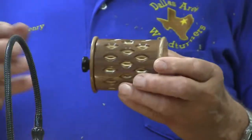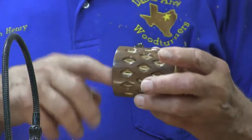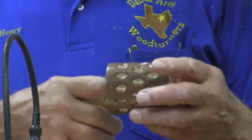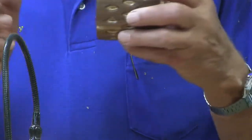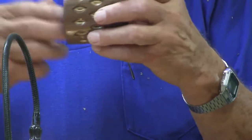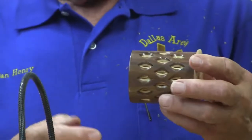I put it on there, and I had to make three cylinders. The inside actually was a solid piece. When I glued it up, then I come back and turned the center out of it. But you had to make three cylinders so that they would just slide inside of each other, where you could slide it together. You didn't want it too tight. You didn't want it too loose. You wanted it so you could still have some epoxy glue in there. And that took a while to do.